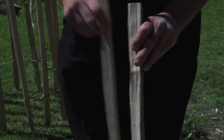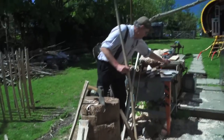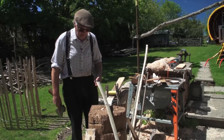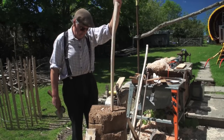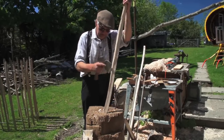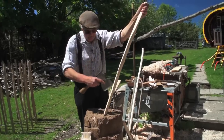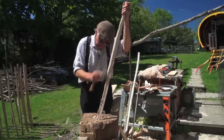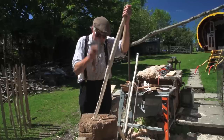When preparing the sweet chestnut, we're always careful not to damage the bark by scuffing it off, because the bark shows on the finished basket — it's quite a feature, the sweet chestnut bark. The inner section of the pole can be saved for chestnut paling fencing or making tent pegs. Nothing is wasted — even the shavings get used for fire lighting. If you want to chop off material, you don't start hacking in the middle because the split will probably run out and ruin the piece of wood. Make lots of small chips and knock those off, so you have control of the depth.